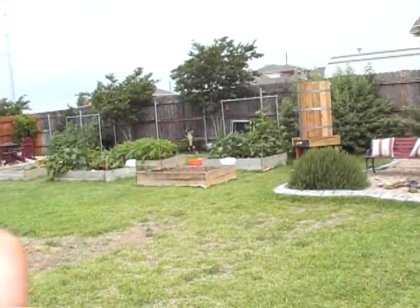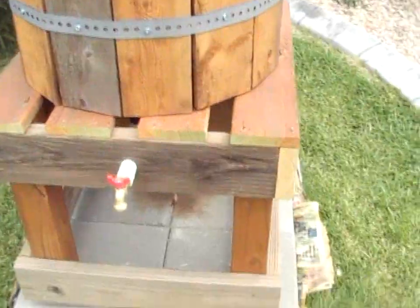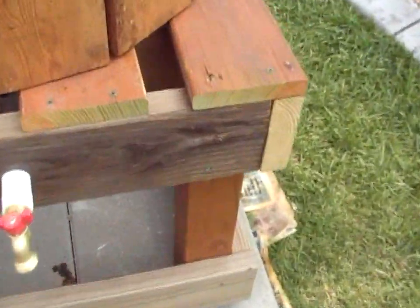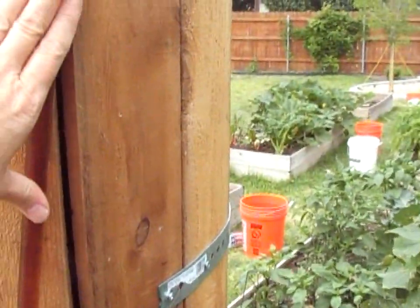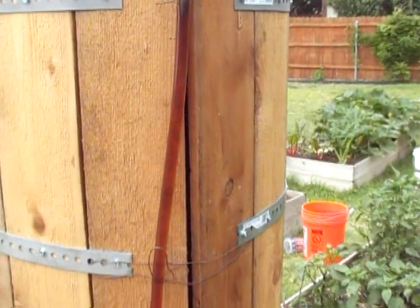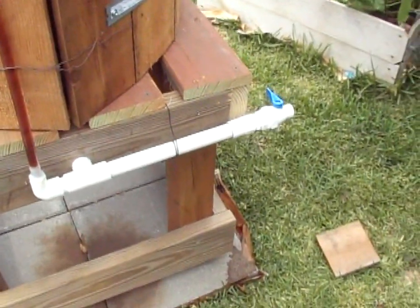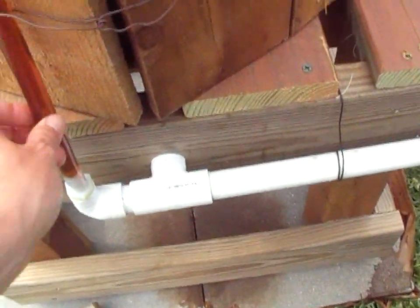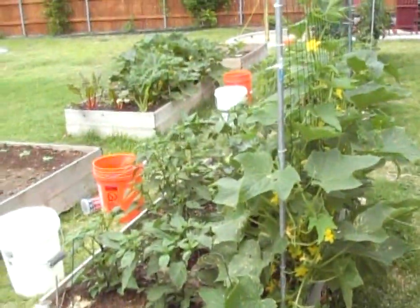Over at the garden I have a water barrel. I can bring the hose from over there and hook it to the spigot to fill from the bottom up, or pour water in through the hole in the top. The brown color on the back is because these were syrup barrels with syrup still in them — it'll take a couple of barrelfulls to clear, but the molasses is actually good for the plants so I'm not going to waste water rinsing it out. It's plumbed underneath with a tee going out front and out this way. There's a gauge so I know how much water I have, and this spigot will eventually connect to the drip system for the garden.